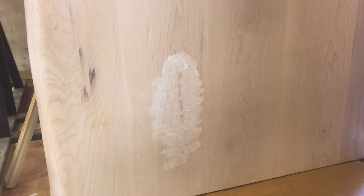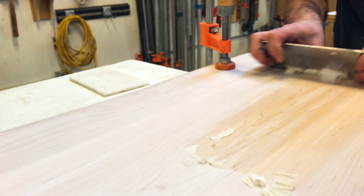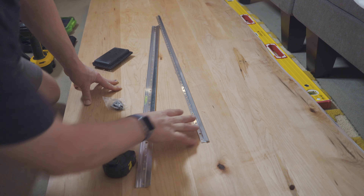I was just past the point of yelling — past swearing — into that small disappointed voice, like 'oh no,' like 'oh golly,' because your mind is just blown. Once I calmed down, I took a razor blade and card scraper and very carefully scraped off the epoxy. Because there was already wax on the wood, the epoxy didn't actually bond to the wood — however it did bond to the finish and made a hole in the finish that looked ugly. So I hoped I could redo that one area and blend it, but it didn't work at all. I don't know — maybe there was epoxy in the wood after all, or maybe this wax just doesn't blend like that. So for the second time I removed all the white wax.